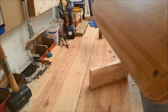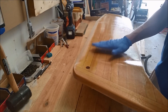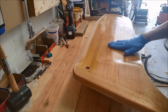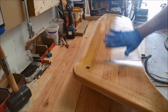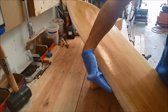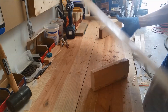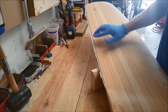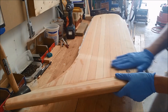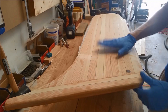I'm ready to glass the other side of the centerboard. This is the side that we did first, and after the fiberglass kicked, I put a fill coat in, so I partially filled the weave of the glass. You can still see the glass, but most of the indentations have been filled in with epoxy. I've also smoothed out the leading edge because I'm going to try to wrap the fiberglass all the way around about three-quarters of an inch to the leading edge side. I've left the trailing edge glass sticking out so that I can sand this side over it and create a fiberglass and epoxy trailing edge. I'm going to fill in a few spots with thickened epoxy where I have a few little voids around my rope, and then I'm going to fiberglass it.